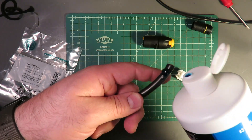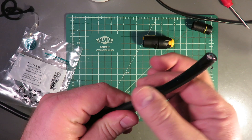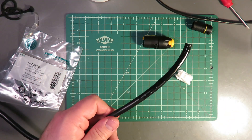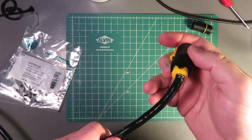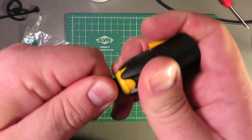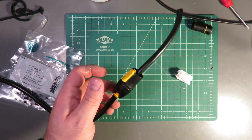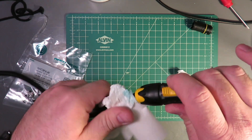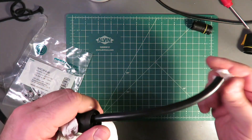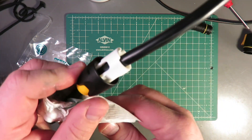You're going to want to have a towel ready, because you know why. Now that you've got a little bit of lubricant on there — this isn't even heavy cable, this is 14 gauge cable — so much better. That part is a nightmare if you don't use the cable lubricant. Now that that's on there, you can unthread the locking tab portion of it and slide on your strain relief. Then we'll start stripping this end.